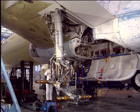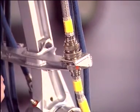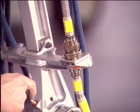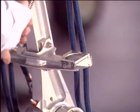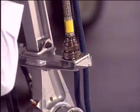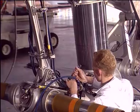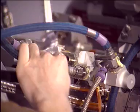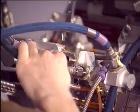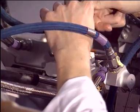In order to accomplish this, remove the electrical harnesses located on the articulated links. Disconnect the hydraulic coupling. During this operation, some fluid will spill from the orifice. Plug the orifice to avoid polluting the system.